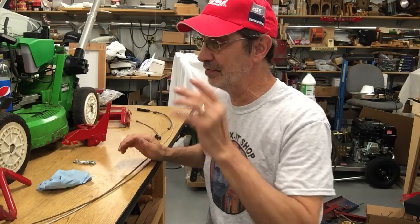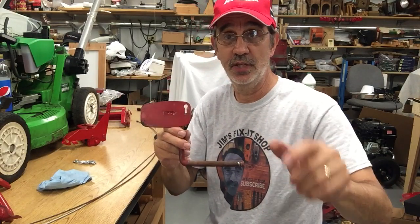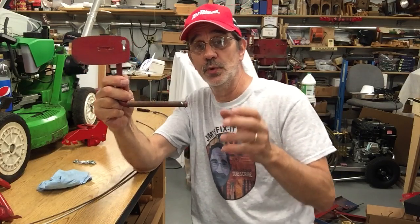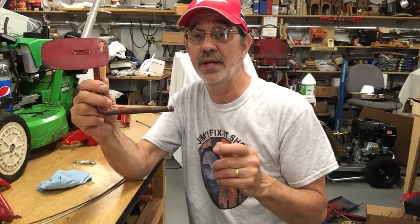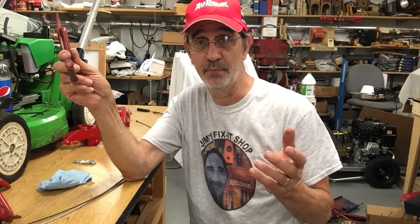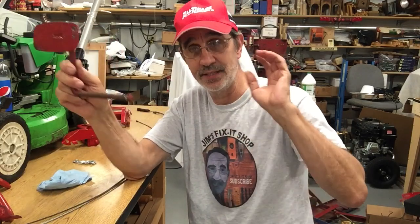There are different styles. This is what most of the old machines have — the pedal goes through the front, the cable comes out of here, goes through the frame into the tube, and it goes back to the yoke or the brake depending on if you have one pedal or two pedals. I sent this pedal to a viewer who wanted to switch sides because of his prosthesis — he had trouble working the pedal — so I got the other pedal out with the rubber pad and sent it to him.